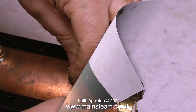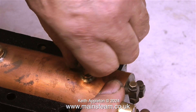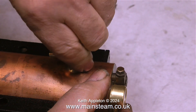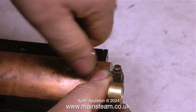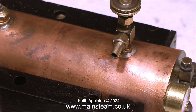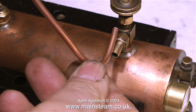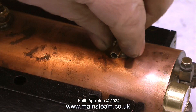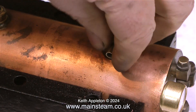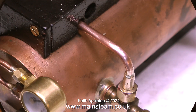I need the tap to have the steam union pointing towards me. I'm achieving this by fitting shim washers of different thicknesses until the tap ends up in the right position. After about five or six attempts using different permutations of shim washer thicknesses I got it right. I then removed the union nut and cone, went into the cold outer part of the workshop, and silver soldered them together.